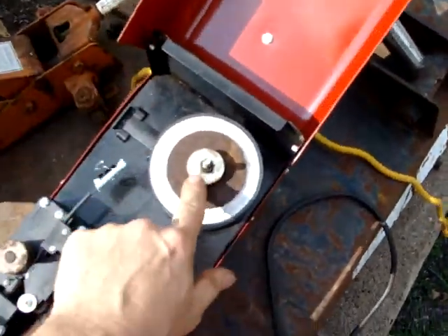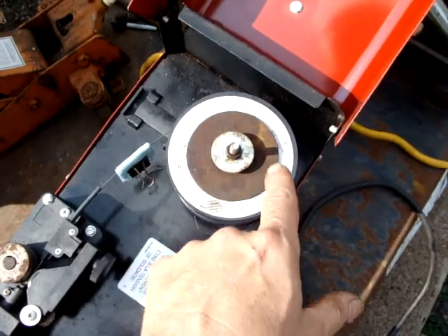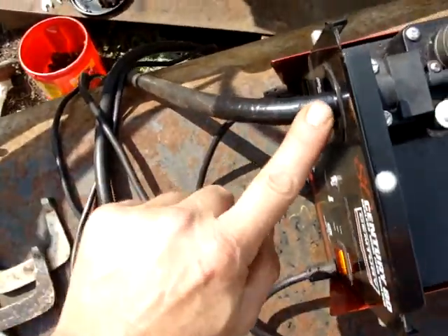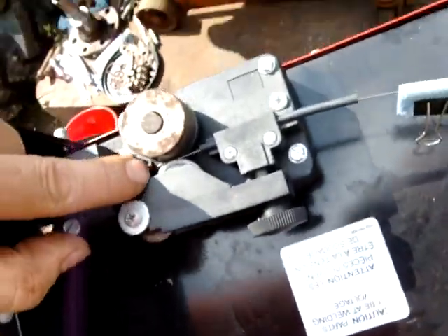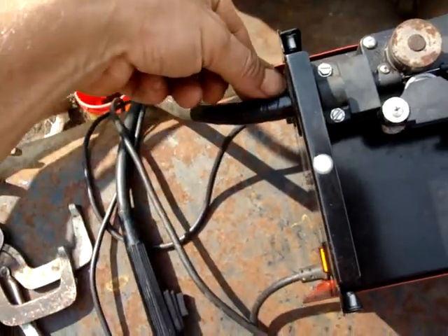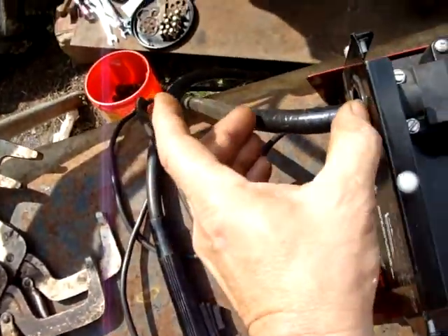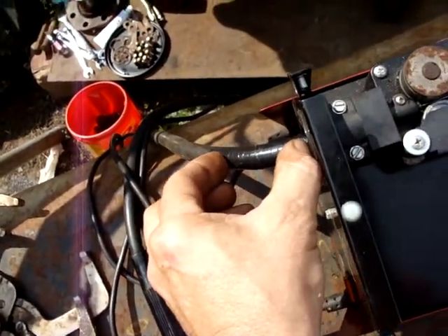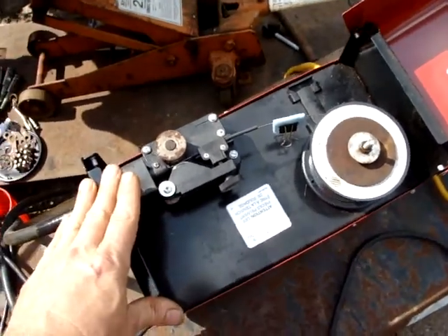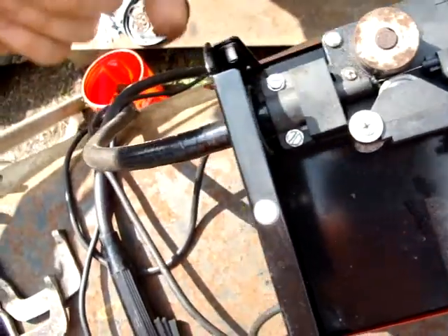This welding wire is flux core, something 71-something-11 — the key number is 11 because you can layer it. The welding torch was messed up; there's a metal tube inside and that metal was all the way down. I had to cut this open to get the metal out. I tried feeding the wire and it went through the outside all the way and quit, then bunched up in there — I wasted probably 30 feet of wire. If you buy one of these used, make sure you're feeding the wire through the metal liner, not through the outside edge.